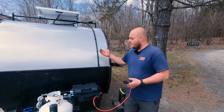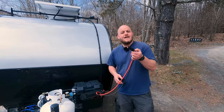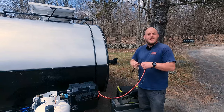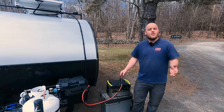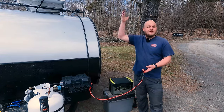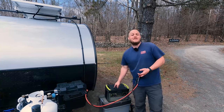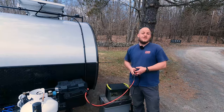My favorite part of this setup is that a lot of times when conditions are good, I'm topped off before lunchtime. That means I can unplug this solar panel and plug it into my portable power station. A lot of portable power stations take MC4s — if not, there's a variety of adapters on the market for any portable power station. Even with the panel in the horizontal position and overcast skies, I'm getting over 50 watts into the battery. This will shoot up to as much as 150 watts, so I get the most value out of this panel when the sun is shining.